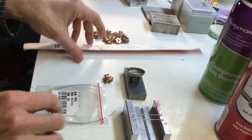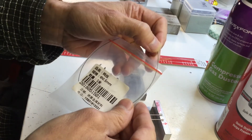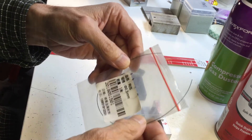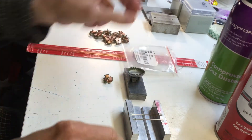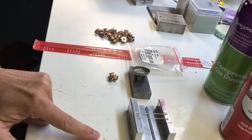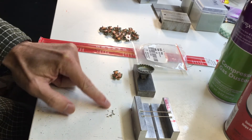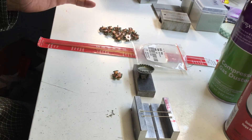For pesky problems I also have some tungsten wire I got off eBay — about a half meter of it. It's half-millimeter tungsten wire, which is basically 20-thousandths diameter. That's a lot more dense than the brass, so if you've got one that's really out of balance you might use that instead. I cut it into little bitty pieces — you can see these little pieces here; the black parts are tungsten.